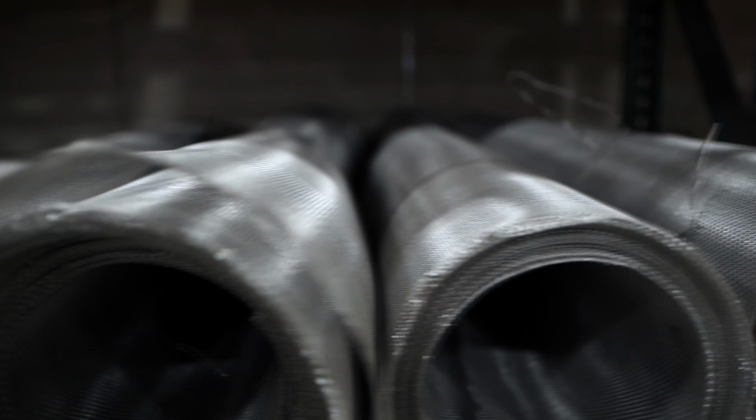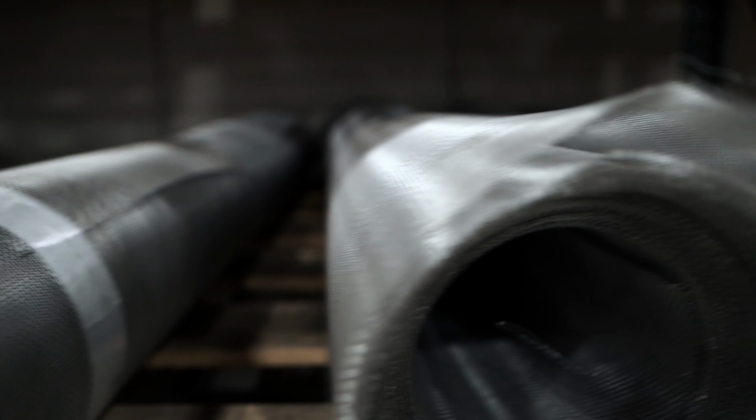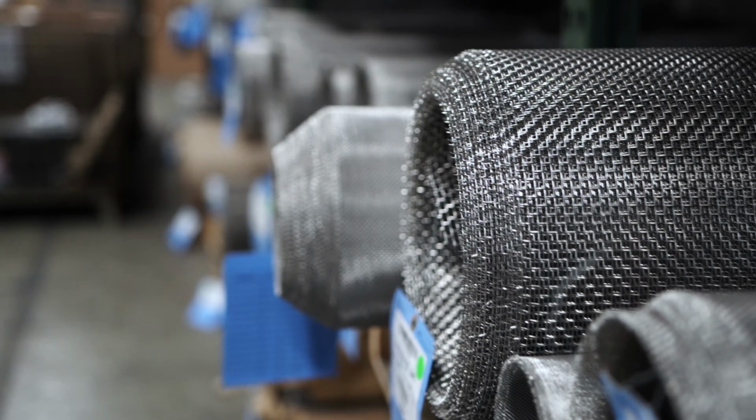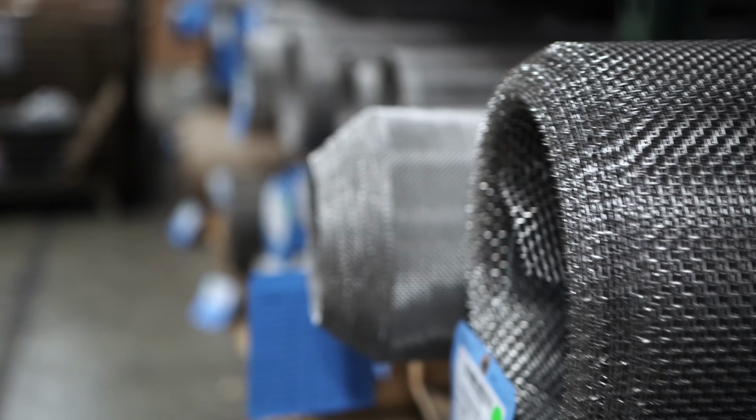Since continuous annealing is a progressive process with little to no disparity, it proves to be the quicker of the two annealing processes. But the increased level of physical characteristics makes the continuous annealing process for wire mesh an intense automated process. And also, as continuous annealing is more controlled, it's typically not as tough on the mesh being treated, which makes it ideal when those finer mesh specifications are being used.